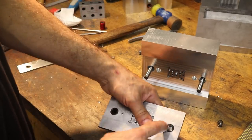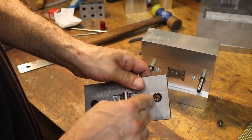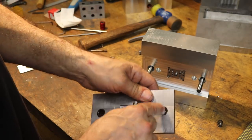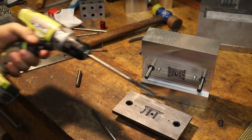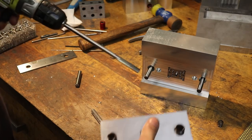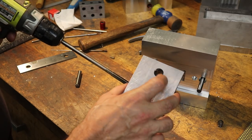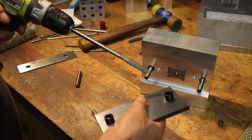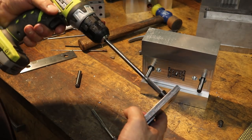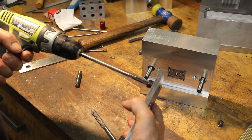So I'm gonna try to see if I can ream out the top of this bearing, and then next time I take this mold apart, I'm gonna have to replace these guys and open this hole up by probably half a thousandth or something. It's just a little too aggressive of a press fit. Okay, so I got this 3/8 reamer, high speed steel. This probably isn't going to be that great for the reamer, because we're going to try to machine off the half thousandth or one thousandth of hard anodizing, which is essentially like ceramic, like what's on sandpaper. But at least we can start our reamer with the non-compressed portion of this bearing, and let's see what happens.